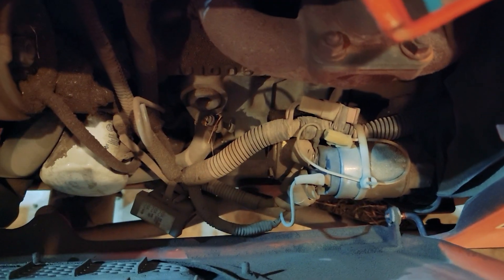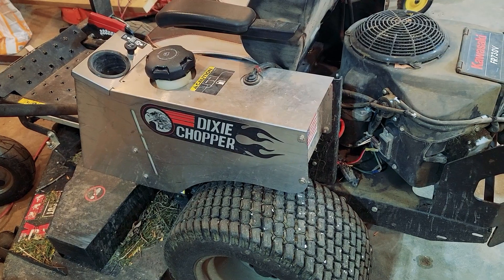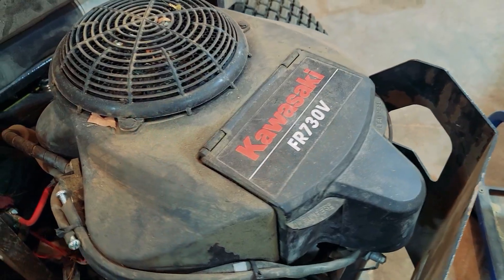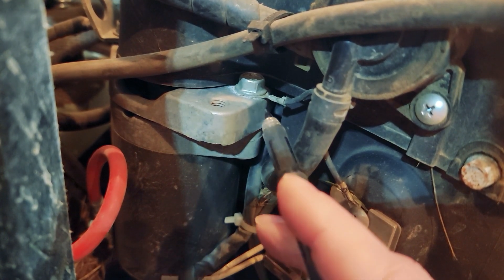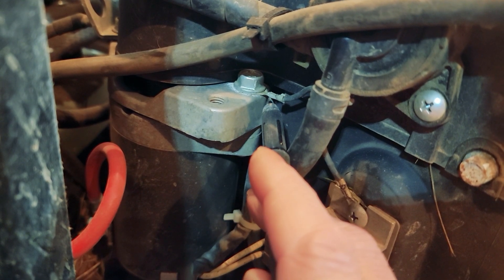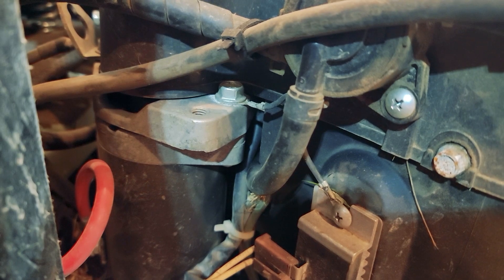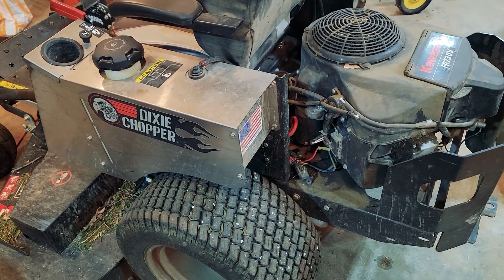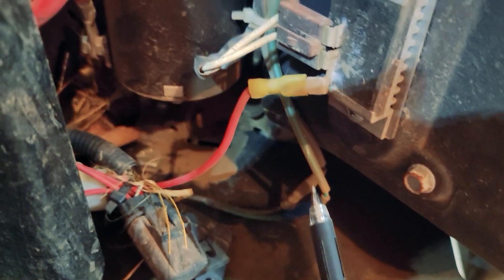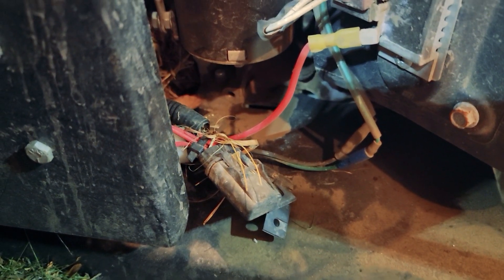My Kubota tractor, also known for their reliability, has a harness containing crimped connections. For contrast, my Dixie Chopper mower's Kawasaki engine from the factory has crimped open barrel connections and plugs — even knowing the engine will be subjected to a lifetime in a harsh, hot environment with constant pounding and vibration and no suspension, they chose the open barrel style connection. The Dixie Chopper itself is another story — it has low quality crimps, not unlike that first stereo in high school, and yes, I've already had to do electrical work on the mower's harness.